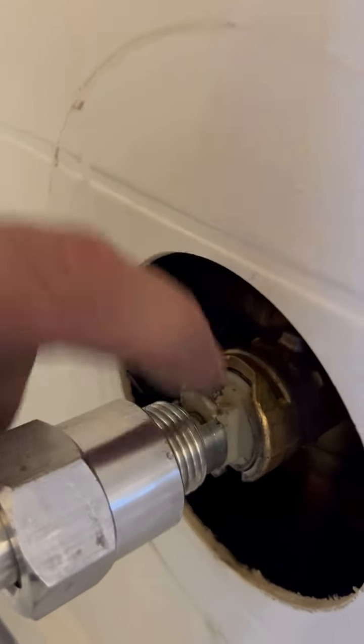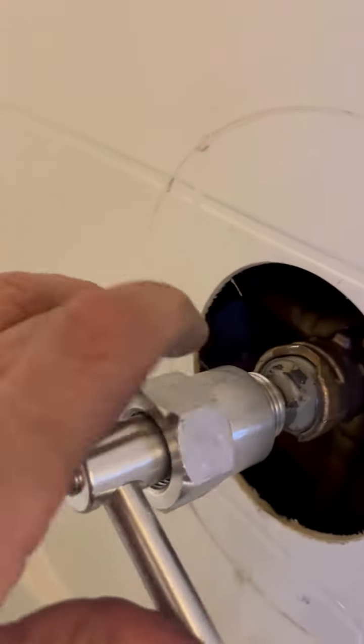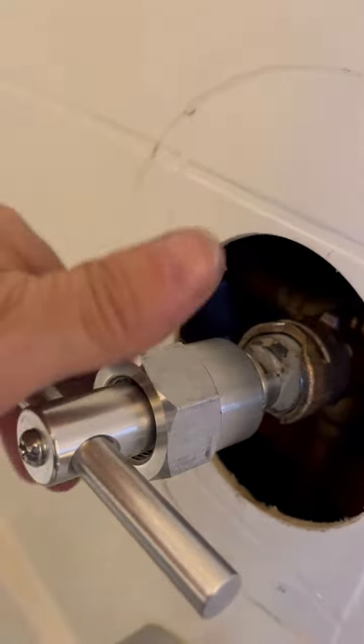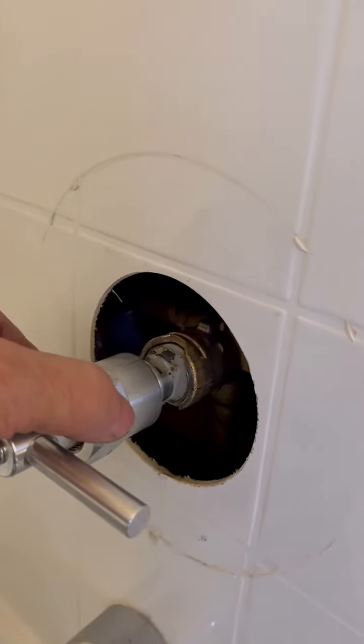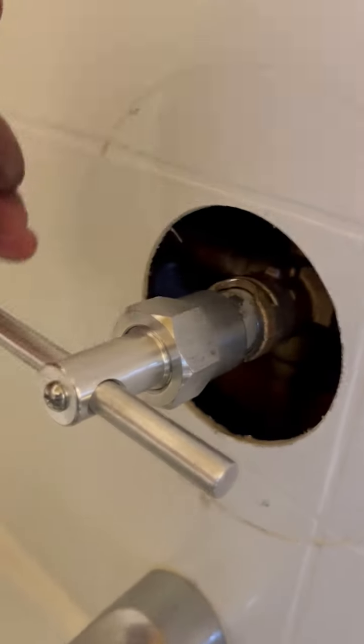You can't do any more with this nut, so I just loosen it back up. This is for to loosen, to break loose the valve itself — you're using torque here to loosen it. The only video I saw made it seem like you just wrenched it out after you got it tightened up, but what's the purpose of this big nut? It's supposed to act like a wheel puller — like a flywheel puller — the screw mechanism is used to help force it off.